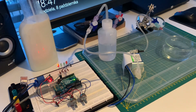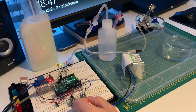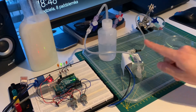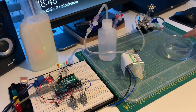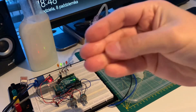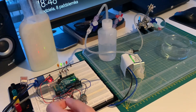In normal operation you want a small quantity of coolant delivered to the system. When I turn the right potentiometer just slightly, it goes into minimum quantity mode — highlighted by the green LED. The system turns on the AC current for the pump for just 20 milliseconds, which is just one full sinusoid of AC current, and that delivers one tenth of a milliliter of liquid with each shot. As you can see, it's not a lot — just making my fingers slightly wet — and that's exactly what we want.